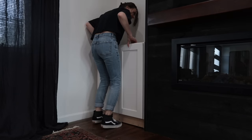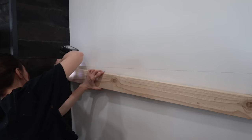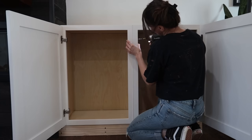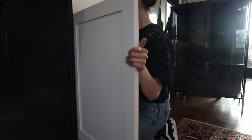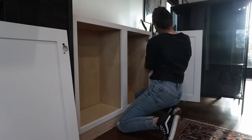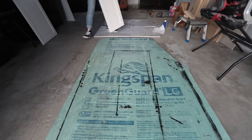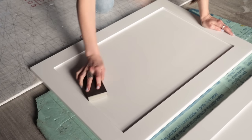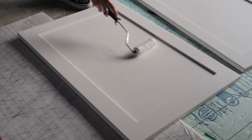Before I get too excited about painting, this is where things get a little tricky. Because my base cabinets are 12 inches but I want to bump them out to 14 inches, I did include a two-by-four spacer in the back of the cabinets when installing them. This also helps make sure they're super sturdy and won't tip over. I'll be covering that with a 14-inch deep topper later in the process, so you won't even know they exist. Since the cabinets are already pre-painted, I had to scuff them up with sandpaper and give them a couple coats of primer, sanding between each coat with 320 grit.